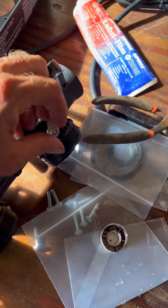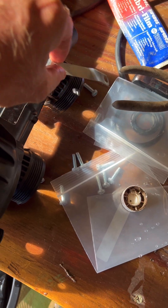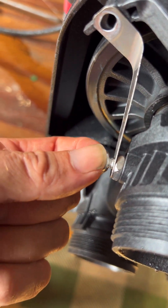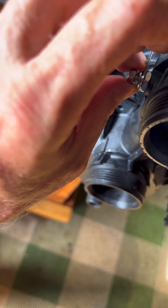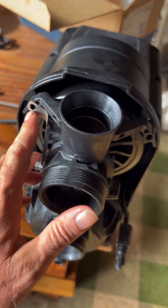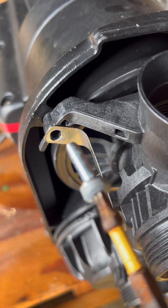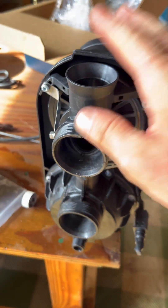We do need this off the old housing — and that goes right here on this one. Drop the lock washer — black washer and nut. So when we put our screw on, that goes through there and there. Put these 10 screws back on: one there, one there, four on this side, four on that side. One thing to note: there was one bolt with a lock washer on it, and that goes in this one hole here.